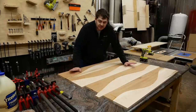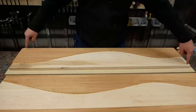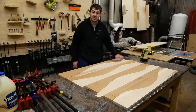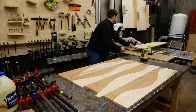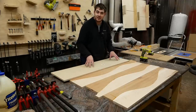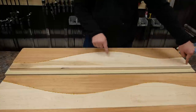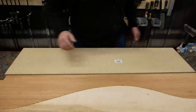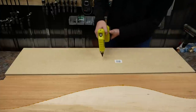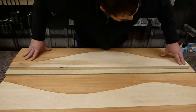These four sections are now glued up and ready to be flattened and planed, but I can't flatten them by just sending them through the planer. Each one of these boards has a little bit of twisting and some have a little bit of bowing, so I need to send them through the planer on a jointing jig — which is just a fancy name for this board. Normally you'd put your workpiece on this known flat board and shim up the high spots so the planer rollers can't flatten it down. But shims are annoying to set up and the workpiece slides around, so instead I'm going to use hot glue — just put several puddles of hot glue down, stick the workpiece to it, and it creates self-leveling shims and temporarily adheres the workpiece to the board.